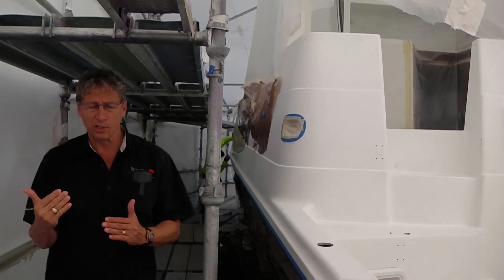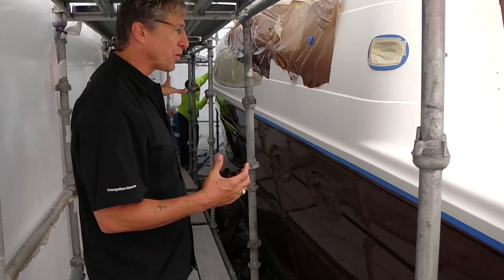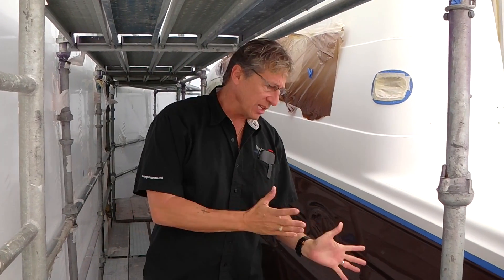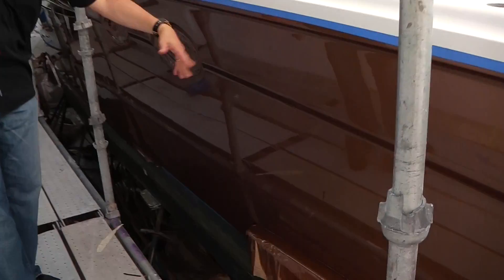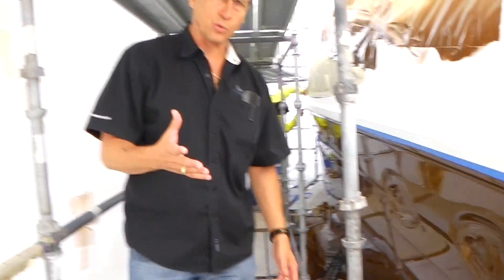When this is done properly and you're doing this metallic paint, you have extraction and you have a filtration system, and it's bagged up, and you enclose and wrap the scaffolding — this is the kind of job you can expect to get when you're doing this. It's almost flawless, no dust, no nothing, and that's what our extraction system's for, and that's the quality of work we produce.